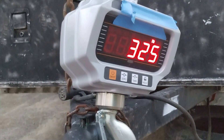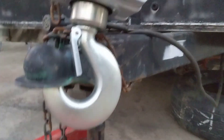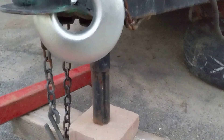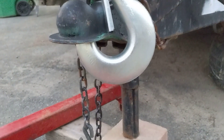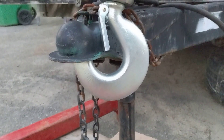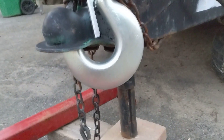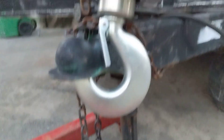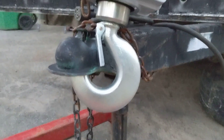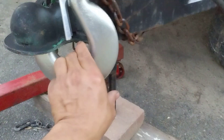I'm going to take it off altogether now. Negative 5 — it's pushing up on the load cell. This load cell can tell you if you've got a negative load. That way you know you've released. Not many scales can do negative loads like that. Because this is actually a remote system, it's now telling me that the load is touched down — it's negative, it's released, and you can pull this out at this point.